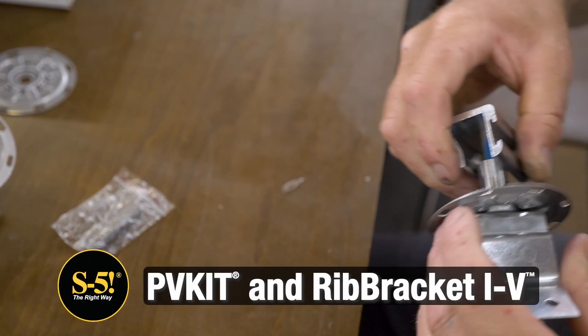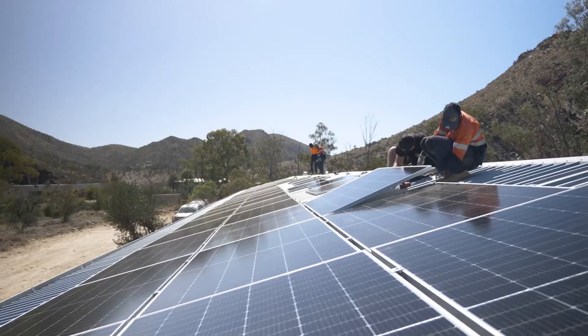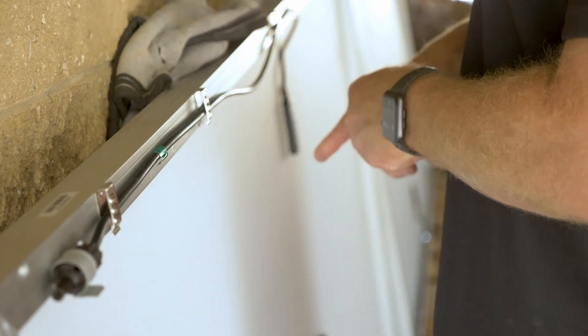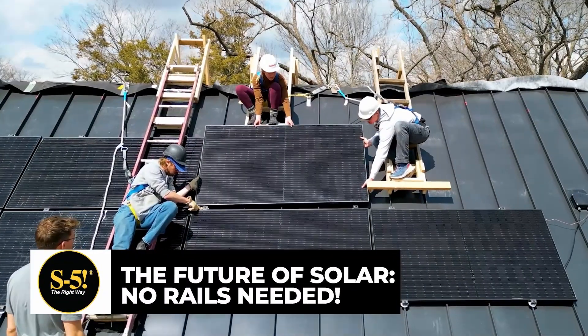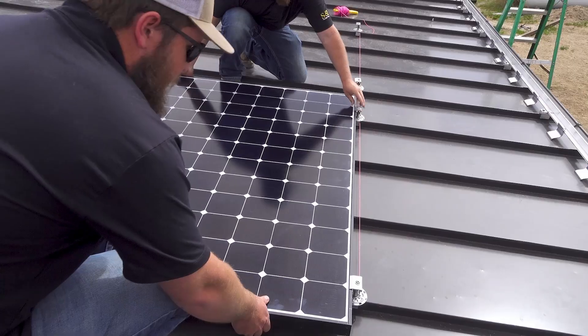Let's see how that engineering and application knowledge pays off in the form of PVKit. Give us an overview of this product and how it optimizes a solar installer's time when they're up on the roof. PVKit optimizes installation time because it is a true lay-and-play system. With other racking systems, regardless of roof type, you have to space out, measure, and be specific with where you put your roof attachments. With PVKit, you really only have to measure out and place your first string line for any given subarray, then build your columns up the roof using your modules and PVKits as spacing jigs. It is a rail-less, direct-attach system. With metal roofs, you can use the ribs or the seams as the rails, so you don't have to ship and carry heavy, long rails up onto the roof and you don't have to pay for them.